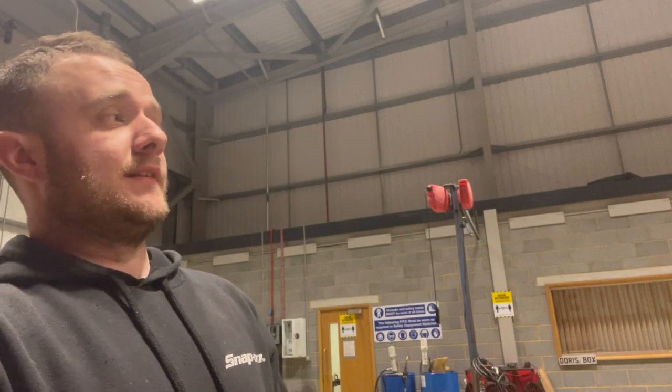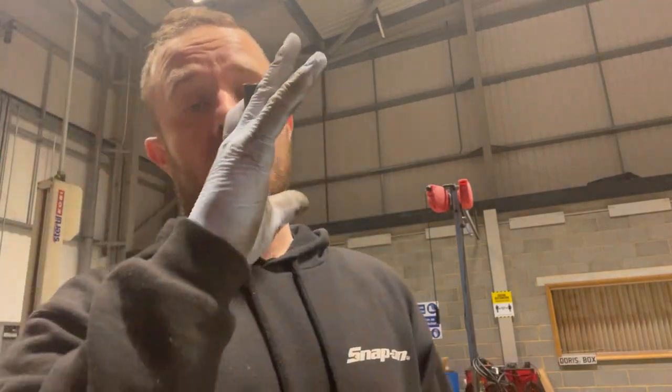So what we've done today, we had the steering arm and the column all taken off. A few things we need for that: T30 for the bolts on the floor, I think. You'll need 17 and 16 mil to take the actual UJs off. Cab bar, and the dash panels, I think they're like 220. And then for the injectors, T35, T40. Just a lot of determination.